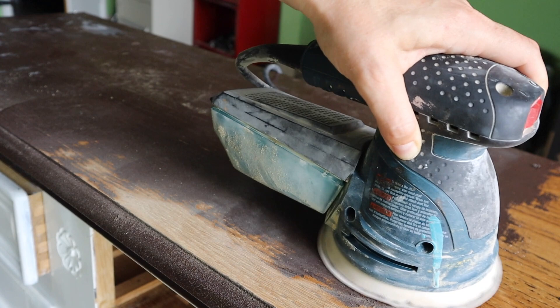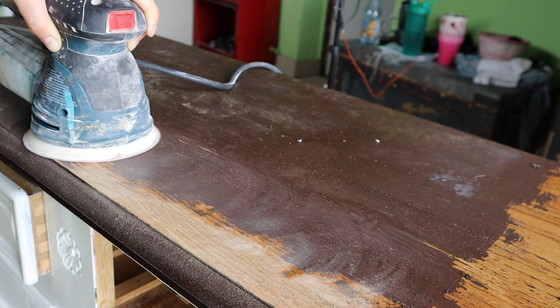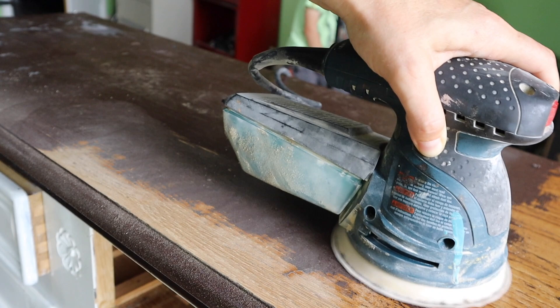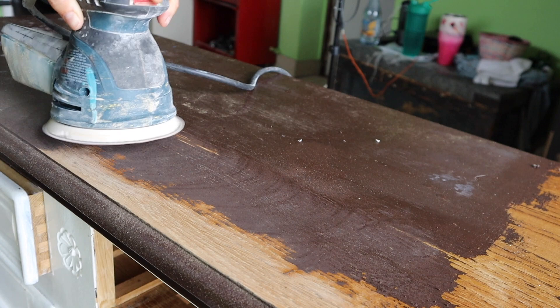In summary, the chemical stripper is probably the fastest to get paint off a flat top, then the heat gun, then an entry-level sander. I do use a Surf Prep sander which rips the surface off, but that's an investment. If you're just starting out, one of these orbital sanders will do a great job. I like Bosch and DeWalt. You can get these on Amazon — I'll put a link below — or at your hardware store. You can see it does take it down to raw wood, but it takes quite a bit of time.